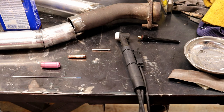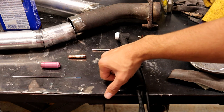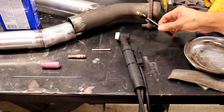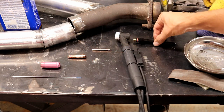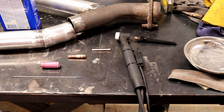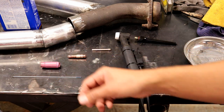I took the denim cover off the torch cord — which holds the gas line, the thumb trigger, and the torch power cable — and inspected it visually for any leaks or tears. Did not see any. This is the anatomy of a TIG torch: you have your tungsten rod, your gas lens, your collet holder, your collet, and then a back cap to protect the extra length of rod that shoots through the torch. Because I was down to my last two electrodes and sharpening both ends, I contaminated one end — it balled up — so I flipped the electrode around and shoved it back in.